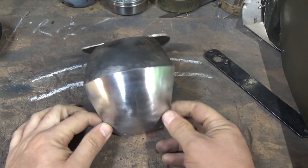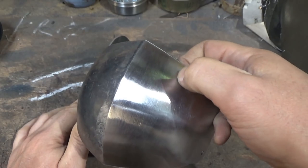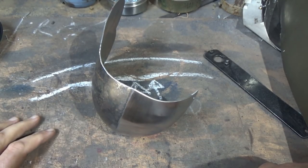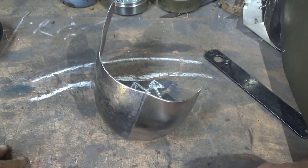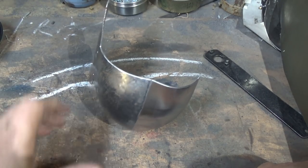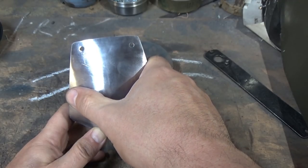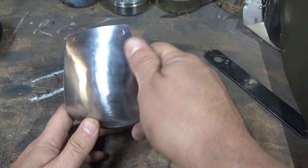All done on a very gentle 80 grit. You can see up close there are a couple of little scratch marks. The thing to remember is if you don't fetch the scratches out here, you won't get them out in the rest of the process. Original armor is filled with scratches, but don't use that as an excuse for laziness. Scratches are often on the peaks of raised areas where they're trying to make edges sharper. It's difficult to reach bits like armpits and bends, so just have a think about what you've got - you will not remove a scratch with polishing alone.